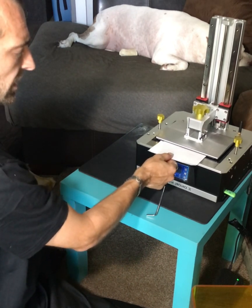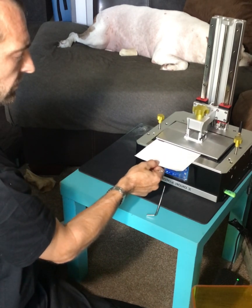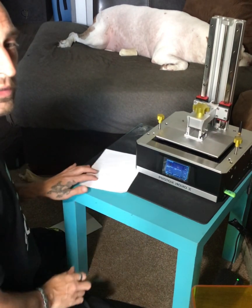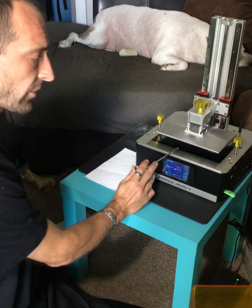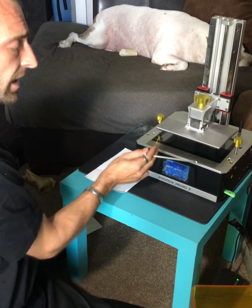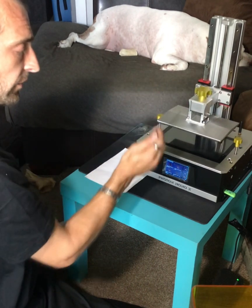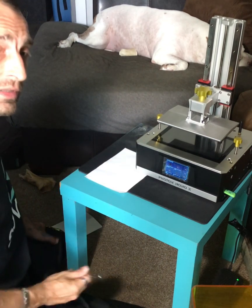Now this next one, this should stay loose. See, now I can move it. And there we go. We have now installed the magnetic plate. Let it sit for 3 days, 72 hours. I did add mine in the sun, A, prior to installing it, and B, after installing the magnet. We have installed it on the bracket again, and we have re-leveled with our spacer, and we should be ready to print.